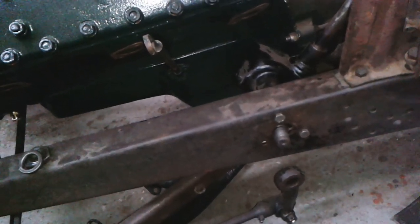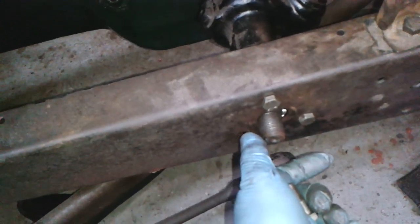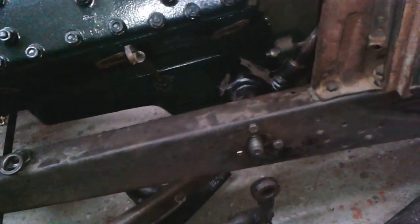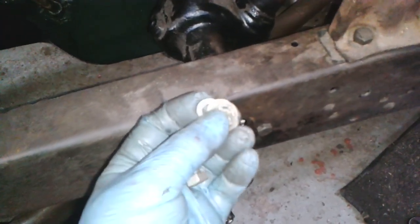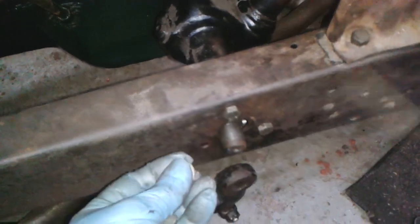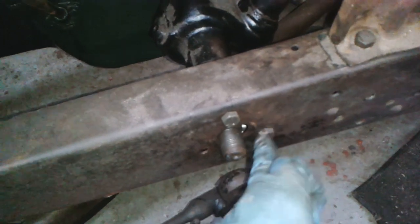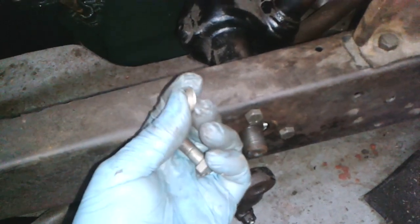What I'm thinking of doing - I haven't tried this before - is put some thin washers on each of the bolts, then have a look where it is and take washers out. I think it will pivot better around a stack of washers than with the flange bolted hard against.